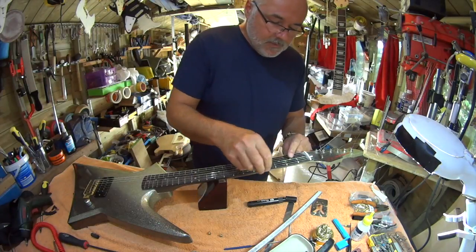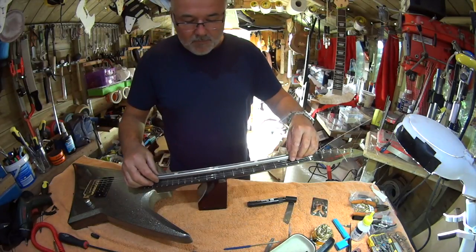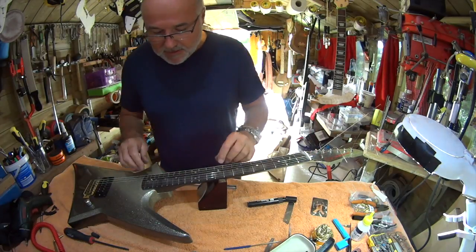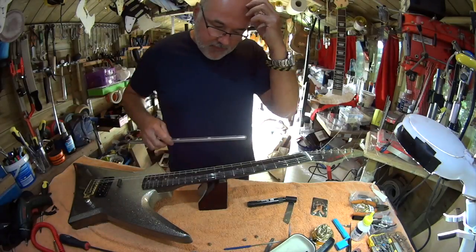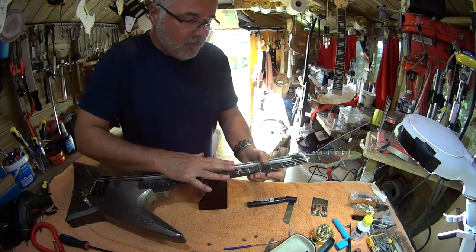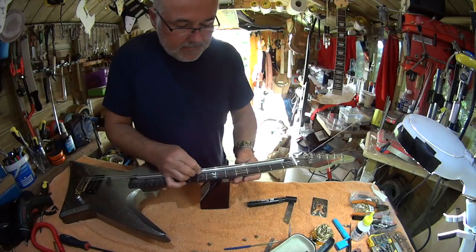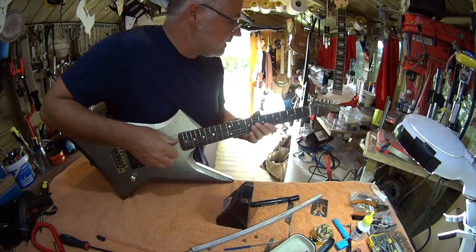Go across now to the D track, check the curvature. Getting a nice run on this U channel rod that I bought from StewMac. I don't know why I bought it. No, I tell you why. I know why I bought it. I bought it because it had extra stiffness, which my rescued out of an old Affinity truss rod didn't have. It's quite a reassuring ability to hold the curve, which I like about it. Okay, check that. I think we're pretty much okay from here on onwards, actually.